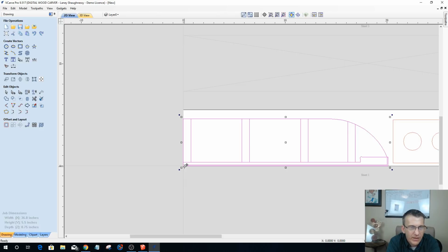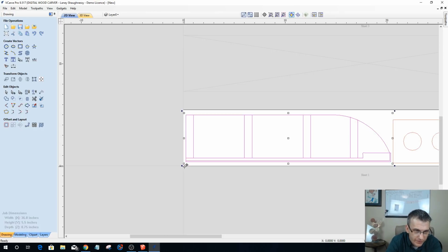The only thing is I've got this measured out at a 5.5 inch board. If my board is 5.55 inches, 5.6, 5.45, and it's not a true 5.5, then I'm going to be off. I'm much better off using alignment pins and flipping this board and aligning it with the alignment pins to ensure that I am exact on both sides. Moving it down to that corner and flipping it and then just changing the XY, if my board is a little bit shorter or longer, then my XY is completely different from where it was supposed to be. So from this corner to here, my XY being 0, if I change it around when I flip the board, then I'm completely off if my board is not dimensioned perfectly. And so I'm much better off putting some alignment pins in here and doing it that way.